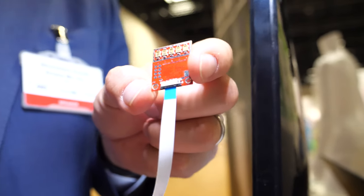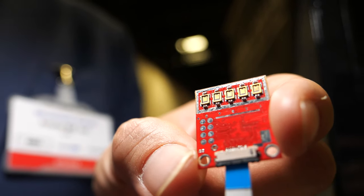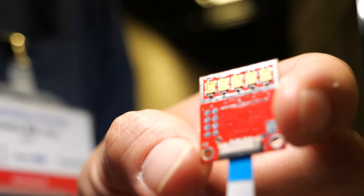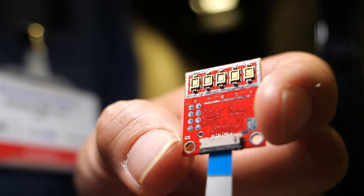This is our compact smell sensor module. What we're looking at here is five things — each of them is a sensor substrate called a QCM, which stands for quartz crystal microbalance. It's a very high precision, sensitive sensor element that can detect the mass of molecules. On top of it is our membrane that functions as a receptor of your nose. There are five of them, each made of different materials with different chemical affinity — basically a stickiness in a chemical sense.